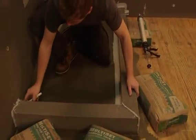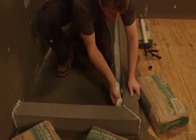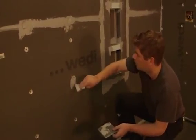Excess joint sealant can now be used to waterproof all fastener points properly. The coverage of joint sealant should be sufficient to cover all visible metal and reach over the edges of washers by at least 1/2 inch.